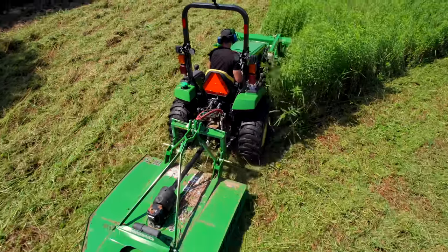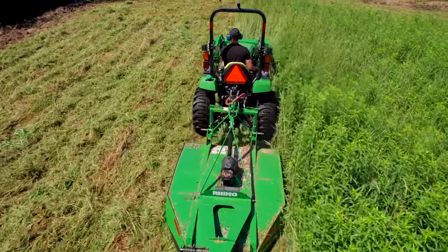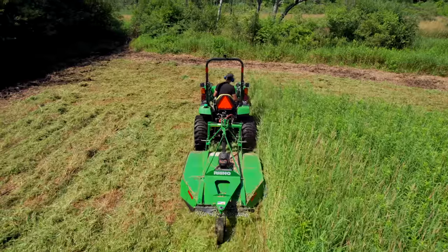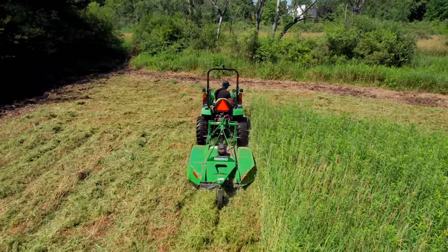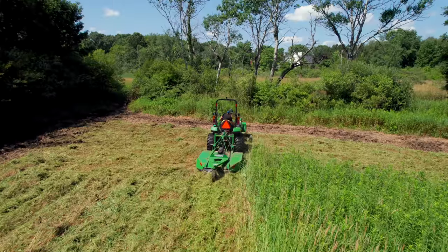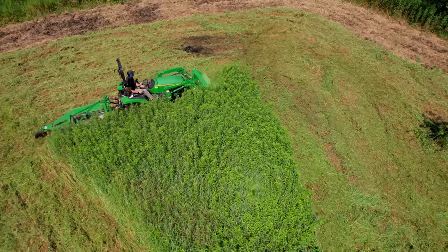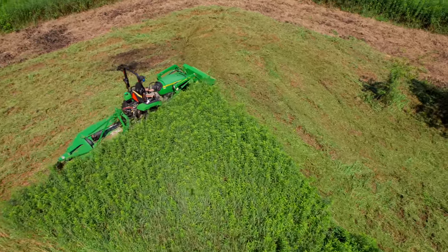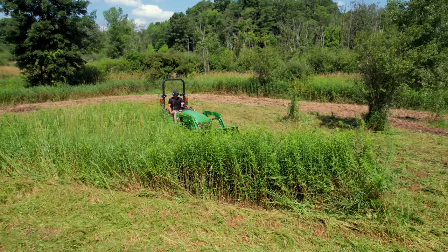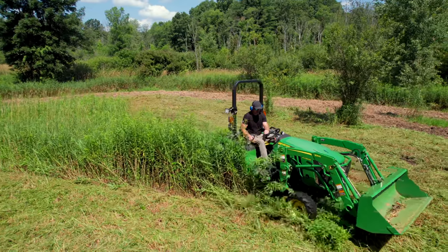Dealing with hills is very dangerous — whether it's a hillside in your field, a hill going down to your pond, or a ditch bank along a road. When you can, avoid side-hilling, driving sideways along the hill. Always drive up and down. Maintain four-wheel drive, as that gives you braking power to the front axle as well. I prefer to back down hills — start at the top and back down. The safest operation is to back down those hills, and it makes sense backing down along a pond because it allows you to quickly climb back up and out if you need to.